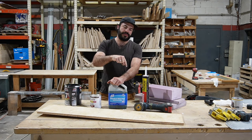The plywood subfloor that we would get, it is better than OSB, but my beef with it is that it would be cupped or bowed, and the wood that was used in the plywood was oftentimes like a pine type wood that was really low density, and it would have lots of voids in the laminations of the ply.